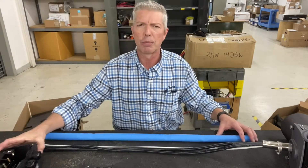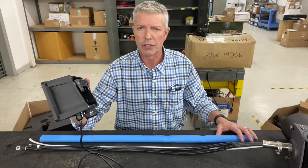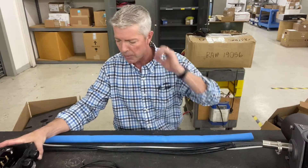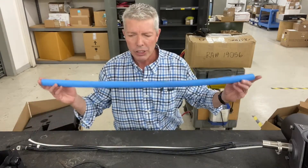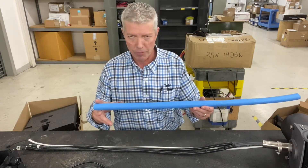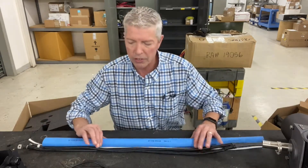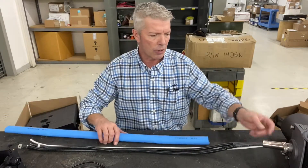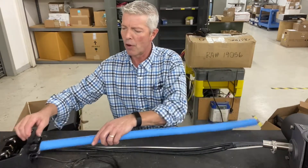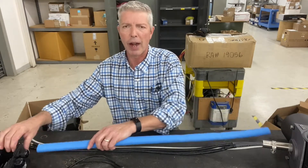This is one of the trickier parts because it's one of the only thrusters where we don't make these connections ahead of time — the solenoids are on the motor themselves. This blue sleeve is meant to go over the hose barb on the thruster and clamp there, then over the hose barb on the control box and clamp there, creating your IP seal within the boat.